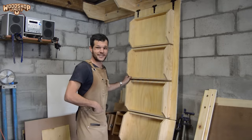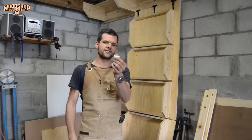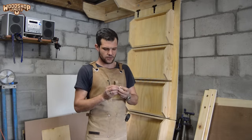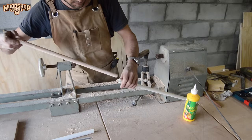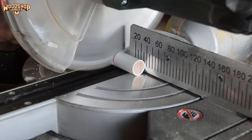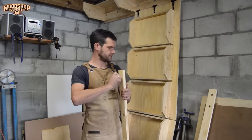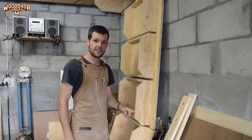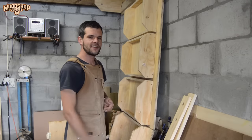So with all the back hinges fixed, I can start installing the pivot pins. For the pivot pins I'm using an assembly which consists of a dowel installed on the inside of a piece of PVC pipe. I couldn't find a dowel that was the exact fit for the inside of the pipe, so I bought a slightly oversized dowel, cut it into smaller manageable pieces, and then using the lathe sanded it down until it was a good fit for the pipe. I then simply glued the dowel inside the PVC pipe and using the mitre saw cut it into these little pieces. The reason I did this is that the smooth surface of the PVC pipe will reduce wear over time as this pin is moving inside the linkage. The pin will be installed into the cutouts using glue, and when the glue is cured, the pilot hole in the center of the cutout will be used to drill the hole all the way through the dowel. When the link is installed, a bolt will be added to strengthen the pin and to prevent the link from coming off.